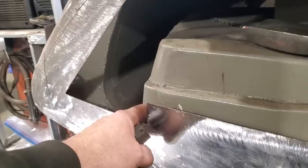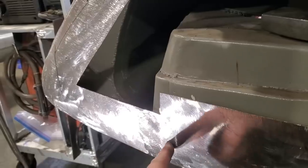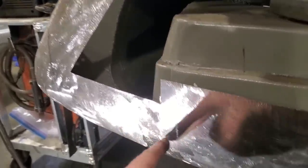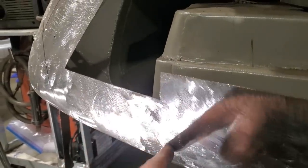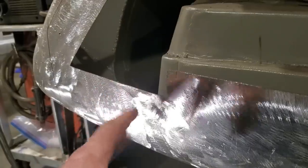Still, even when I get on the back side of it, it's not an easy thing, because you gotta realize this distance here from here to here now is longer, okay? It's very hard. Like this here almost gotta be shrunk in this area here. What I usually do with this here, if I'm really meticulous about it, I'll cut it again. I'll go back and do it over and start welding it up again, taking my time.